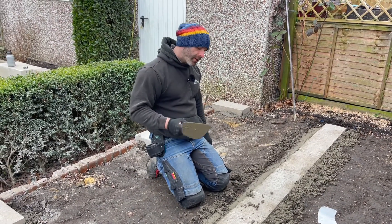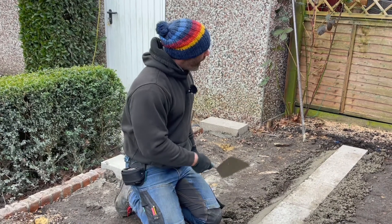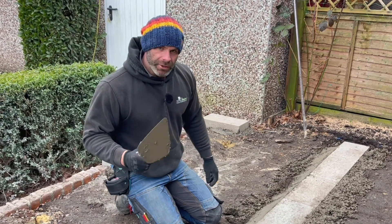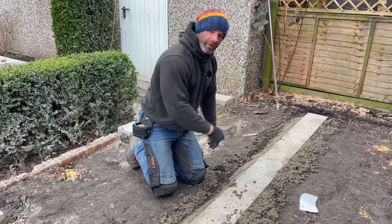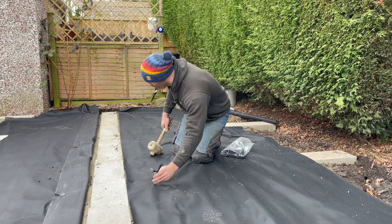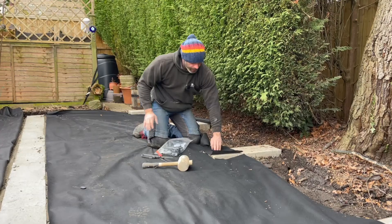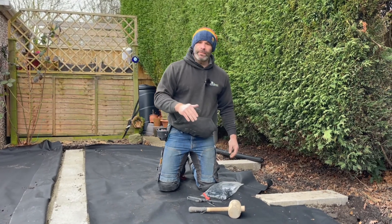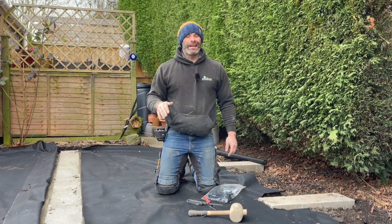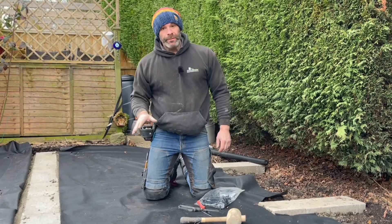One final side note on these concrete blocks: because we've laid them directly onto wet concrete without a sand and cement joint, I'm just going back along now and putting a generous concrete haunch in just to make doubly sure that they can't go anywhere. Blocks are done now. I'm no carpet fitter, but weed membrane is very important. There will be a little bit of light that gets to the ground in between the deck boards because the deck boards have a small gap, and it doesn't look good if you've got grass growing out of your deck. This stops that — weed suppressant membrane pegged down, not decorative, very functional, and in my opinion absolutely crucial.